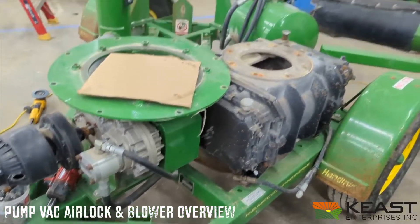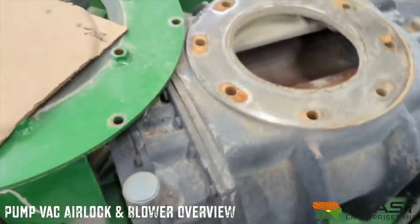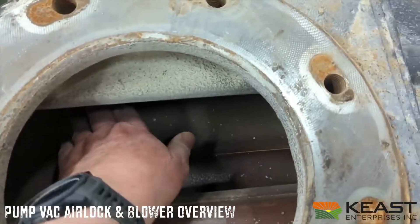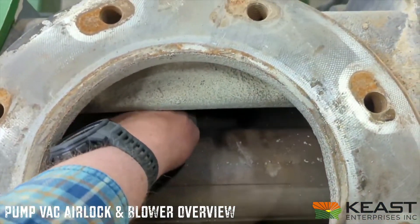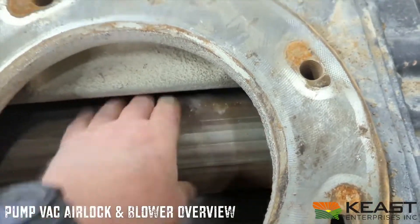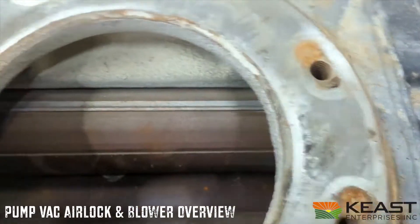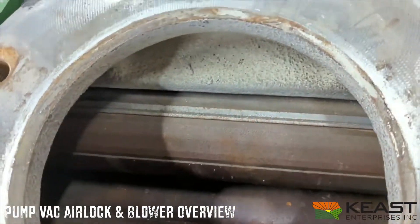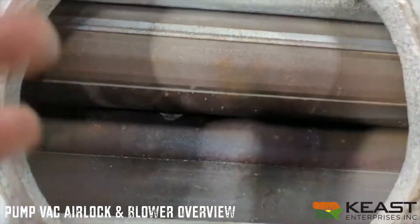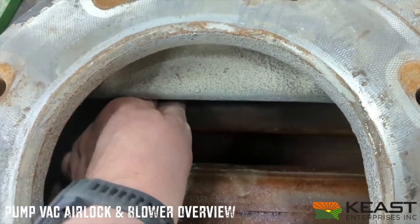This is the Handle Air 680 grain vacuum blower dismantled. I just wanted to show you the blower and kind of how it works. There are lobes inside here — the lobes turn and move the air by turning at about 3600 RPM. This blower is a very nice blower; the noise is very low. You can see the lobes and how they turn, how it grabs the air and moves it through the blower.